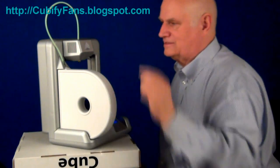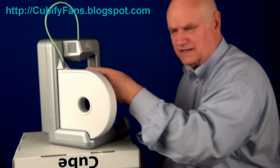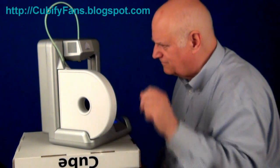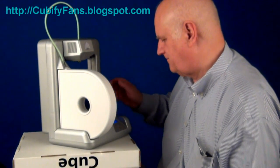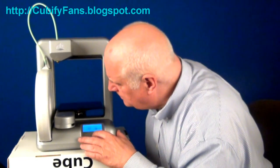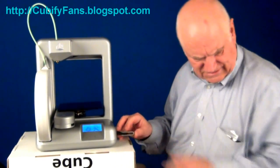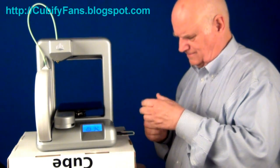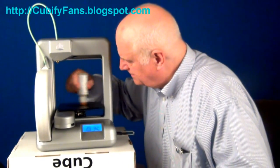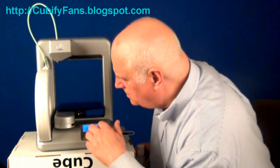Hit the button. Now instead of pushing it out like it was trying to do before, now it's pulling it in. And I hope to see a little bit of extrusion come out of the print head. It's loaded up. So now we need to print something. For that I have this and something called magic glue. I took the top off — you don't unscrew the top, you flip it off. There's a little pad there. I'm going to spread this magic glue around. I've spread around the magic glue and now I'm going to go to print.